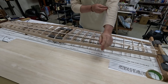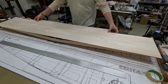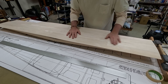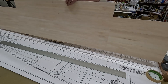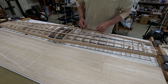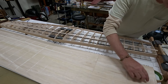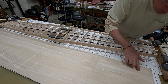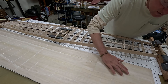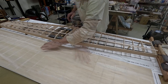The base glue is down. Now we put the sheeting on top — we're just going to transfer some of that glue to the sheeting, then peel the sheeting back off. You can see the glue has transferred. Now I look for dry spots, typically just using my finger to run over everything and spread the glue out. At this point we can take our time because the glue has to dry before the next step.